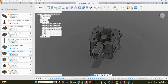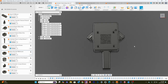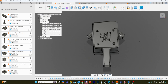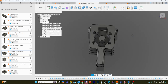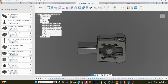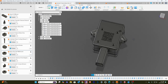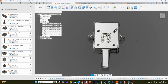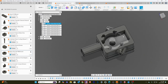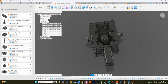I also want to try an inverted V. With the inverted V, it's not supposed to be so directional. In a horizontal position, it's sort of directional, but when it's vertical, it's omnidirectional. At a 45 degree angle, it's kind of omnidirectional. So I wanted to try both and see which one works better. It's basically the same box, but the studs will come through here. You connect the ends of the studs with little ring hoop mounts, or you'll see when I go out and make it.